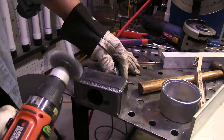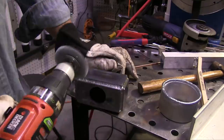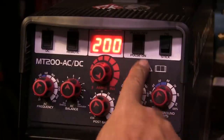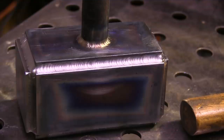Got a lot of welding to do here and we're going to mess around with some pulse. I forgot to wire brush it off - I like using a drill motor or a cordless grinder with a wire wheel so it doesn't sling bristles. I'm going to set the pulser to about one pulse a second. It's kind of hard to achieve with dials, you have to play around with it, but I'm just leaving the wire in the puddle.